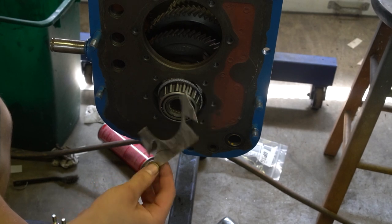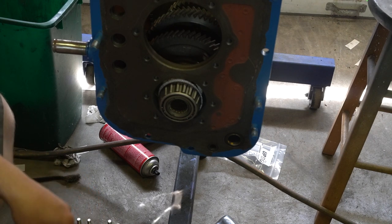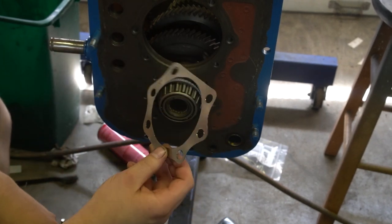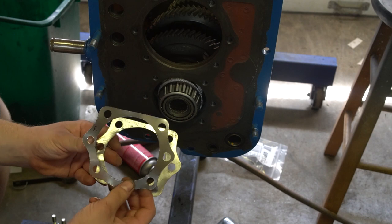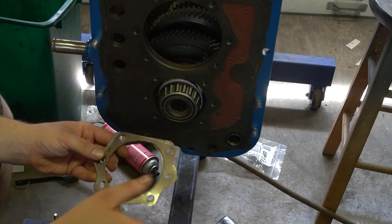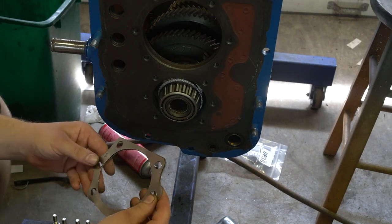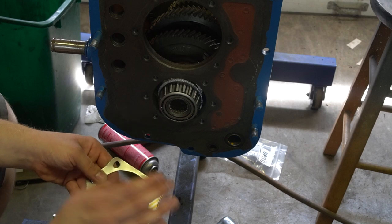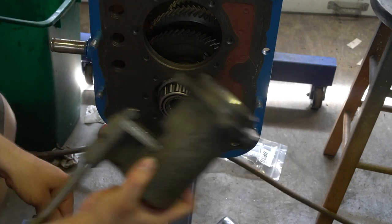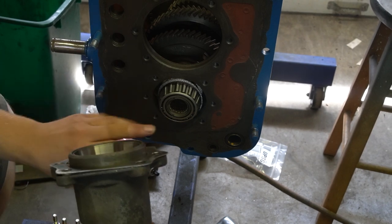That dropped me down to about 11 pounds pull, so I needed to be in between them. I bought some 5-thousandths thick stainless, which would give me an option to do a 40 or a 45. My range was 40 to 45 thousandths that I needed. So I went ahead and made one first - we're going to check it and see how it is. We're going to go ahead and put these on through our PTO shifter and get it installed. The PTO shaft is actually not in here at the moment.